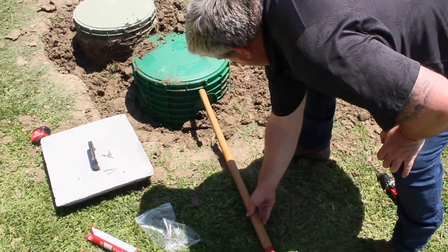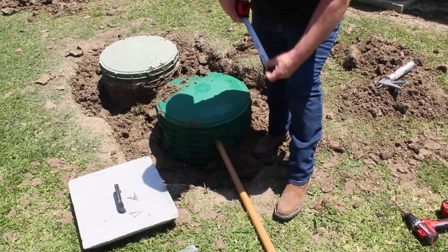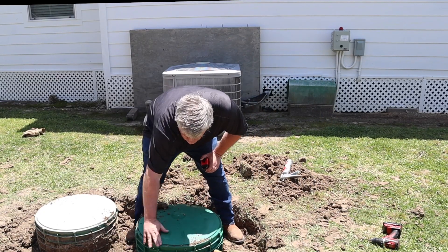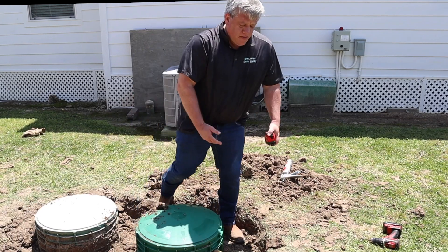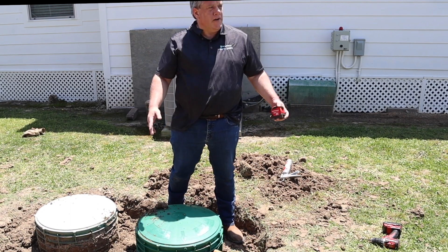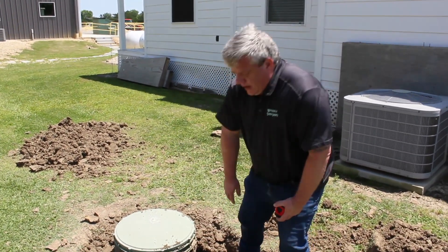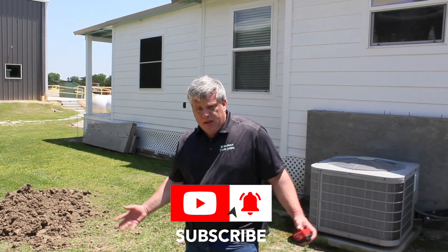This isn't the most level ground, but that's about how much clearance you're going to have — about four inches from the top, maybe five with the top piece. If you put them too low, dirt gets into the screws and you have to clean it all off to open them. That's why we like them a little elevated. So that's how you install a riser, how you measure for it, and which one to pick. If you want them buried under the ground that's fine — it's just our preference to keep them slightly above grade for easiest servicing. Give us a call, click like and subscribe, and hope you have a great day!